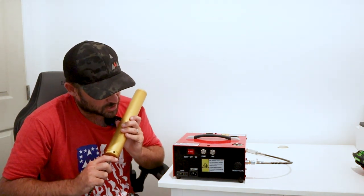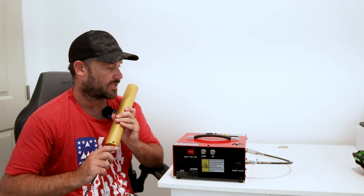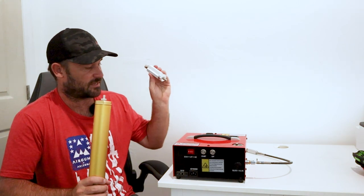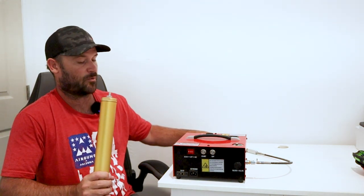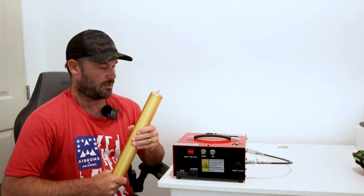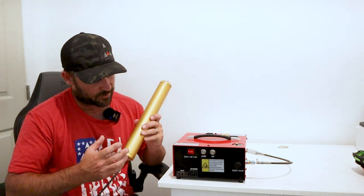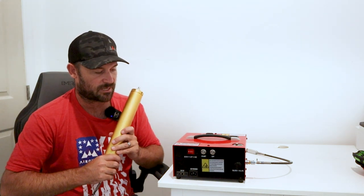My recommendation for a smaller compressor kind of depends on where you live. If you live in a very dry area, you can get away with a very small inline filter like this, maybe two of them. But for very wet areas and filling an air gun, I do recommend a larger filter of some kind, whether that's a Tuxing or an Omega. But like I said, you're going to have to turn it on and off a few times just to pressurize the filter before you pressurize your air gun.